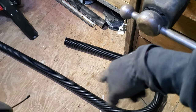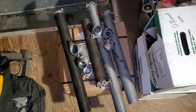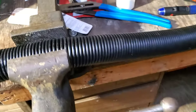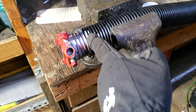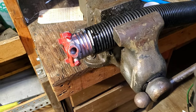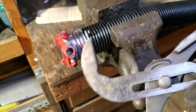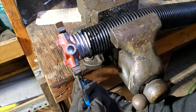Here's the leftover spring — this is a raw spring — and here's the new one. I had to steal these cones out of the scrap hopper because we can't get cones from our vendor anymore with the whole situation going on. I'm going to make myself a couple more. After we get this torched up just a little bit, we need to spin the cone on. I spray a little bit of lube on the spring and inside there just to help it spin. It's just like threading it on — just like a screw.